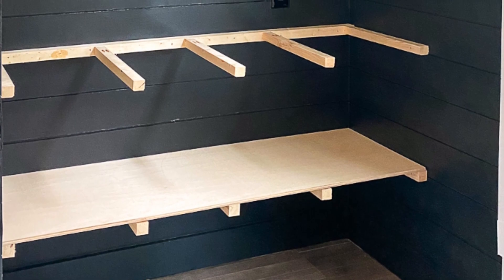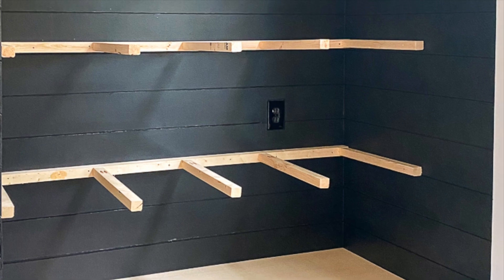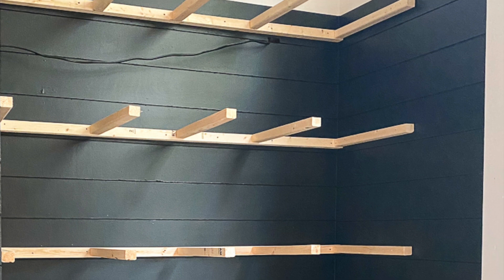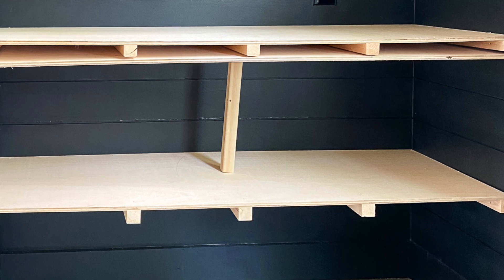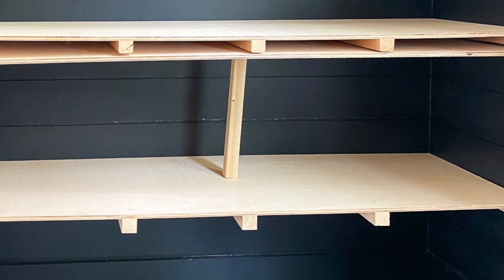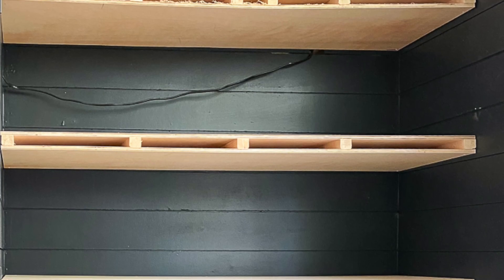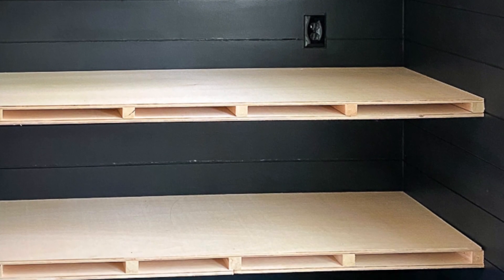Now you're ready to cut your plywood to fit the top and bottom of each support. You'll need a table saw or a circular saw for this step. If you don't have one, Home Depot can make your cuts for you when you purchase your plywood. Cut your spacers just enough to fit the bottom sheet of plywood to the underside of the support — this helps you work against gravity and makes it a lot easier to attach the bottom plywood while the spacer holds it up. Working your way up the wall, face the top and bottom of each support with plywood using one and a half inch wood screws to attach.